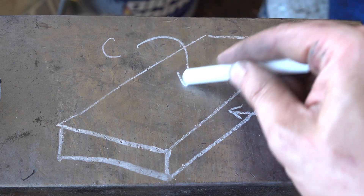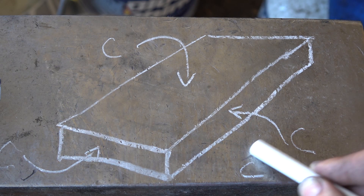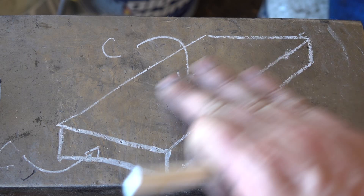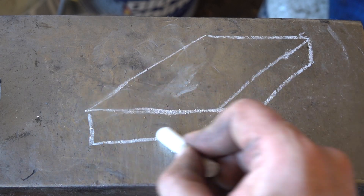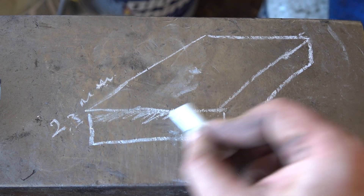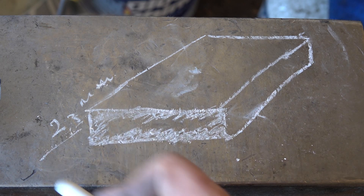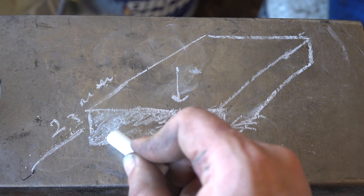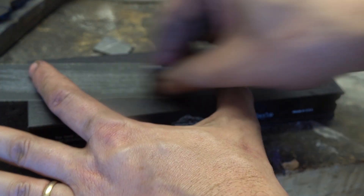What happens is carbon is changed into carbon monoxide, and then that gas penetrates into the steel and deposits the carbon. If it goes 1.2 millimeters, let's look at our piece of iron in cross-section: our iron is 2.35 millimeters thick. If we're getting 1.2 millimeters of penetration from all sides, that's 2.4 millimeters — so we should be depositing carbon along a gradient through the full thickness of this piece of iron, if it sits long enough at high enough temperatures. We'll polish up our control and test piece to 800 grit and etch them side by side.